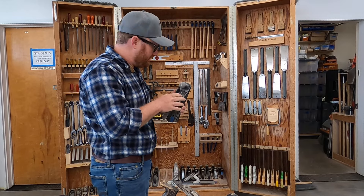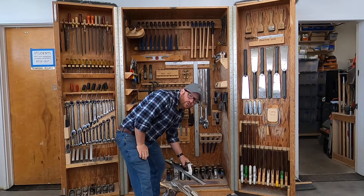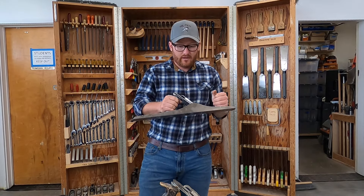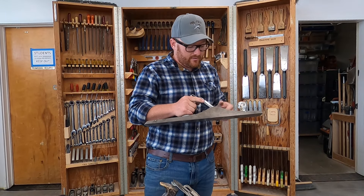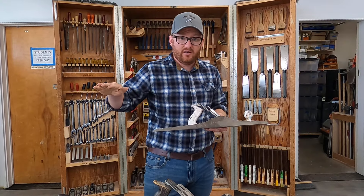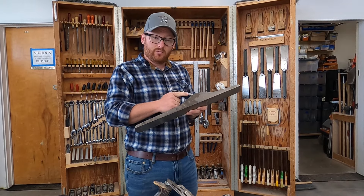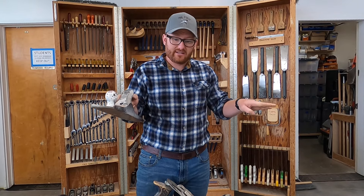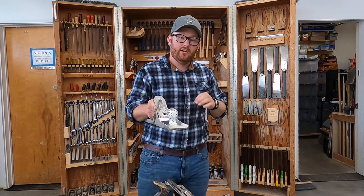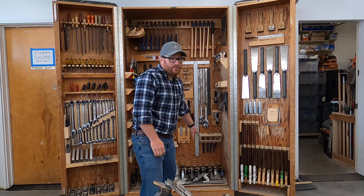We usually round over the corners of this smoothing plane just ever so slightly. Whereas a jointer plane — much larger than the jack plane — is designed to ride over all the bumps, slowly shaving off the tops of them to flatten the board out. That's why it's called the jointer plane: it helps you flatten things so you can join or glue them together with a nice tight flat seam.